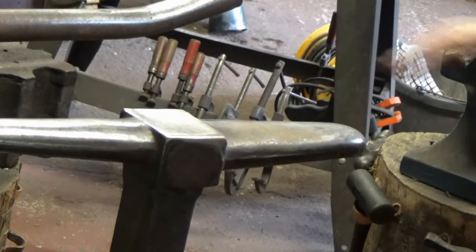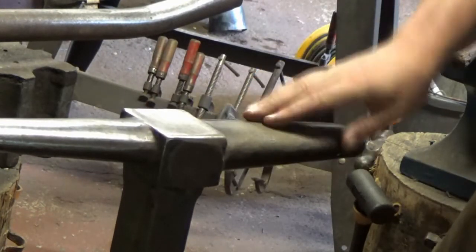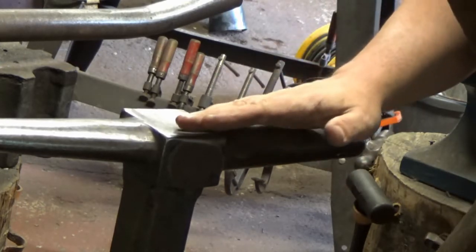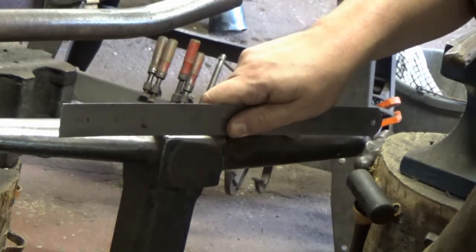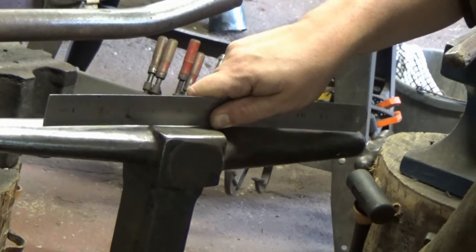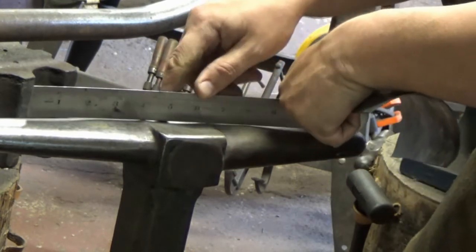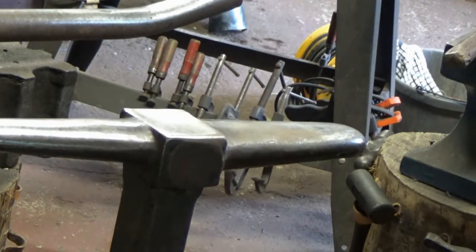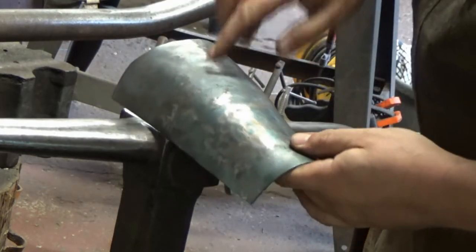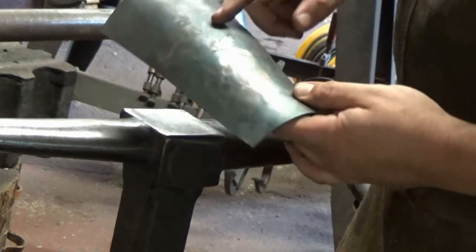One of my major planishing tools — or stakes — is this here. It's a T-stake that I've altered slightly. I've put a couple of millimetres of dish throughout it. It's a bit tricky to see, but with a metal ruler you can see it starts with no light bleed, then as we move back there's a little bit of light bleed through the middle portion. The reason I've done that is because very often in armor there might be a small dent, and rather than push the surrounding material down to it, I want it lifted out.